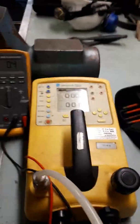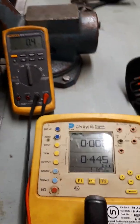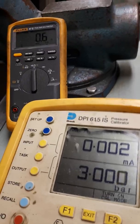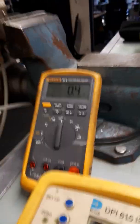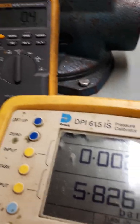Now it's time to check where the switch is set. By watching the meter and the pump at the same time we can check at what pressure the switch changes state. I'm now pumping the pressure to 2 bar and we can see the switch is still closed. When we begin to see the state of the switch fluctuating it becomes apparent that we are getting close to the point at which the switch activates.